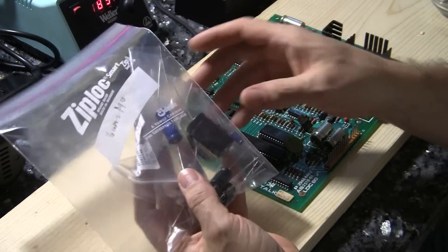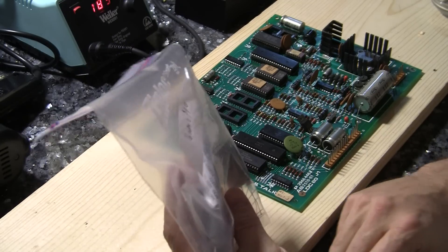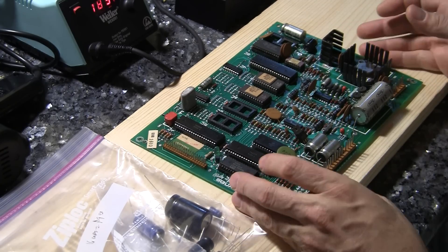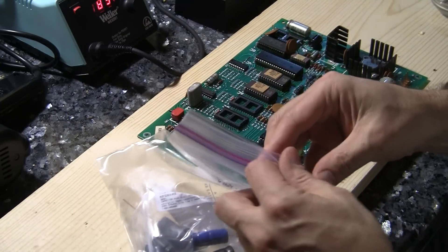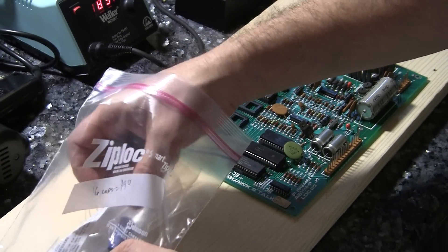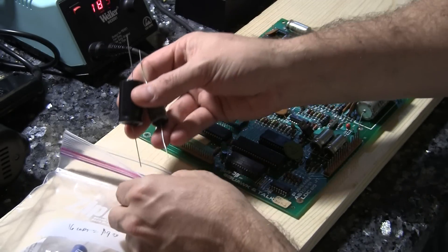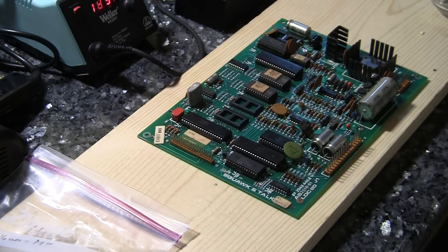You can also look up what the capacitors are and order them wholesale, though it actually costs a little bit more. There are about 16 capacitors on this board — about nine bucks if you buy them in quantity from different places online. So I'm going to, one by one, be desoldering components off the board and replacing them with new capacitors. We've got some big ones and some small ones, and hopefully we're going to just basically bring this board back to life nice and fresh.